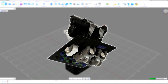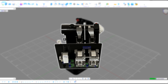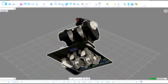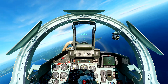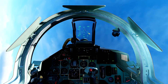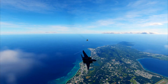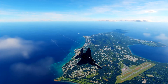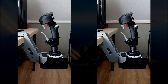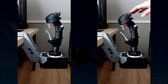The throttle follows the same design principles. It's got dual levers, rotary switches, toggle switches, and an encoder — all managed through another pair of GPIO expanders and a 16-bit ADC combo. And most importantly, it feels good. The inputs are solid. There's haptic feedback which can rumble on missile launches, trigger recoil effects, or just give tactile feedback on button presses, and the chip supports a massive range of effects, preloaded and customizable. I also added adjustable dampening to the joystick gimbal, accessible by removing the leather boot in the base, plus a customizable detent system and adjustable friction for the throttle levers.